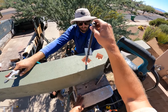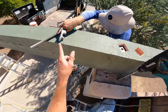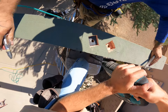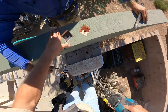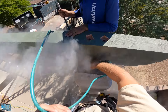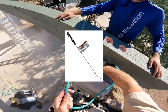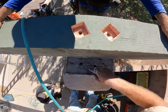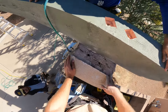One thing that's really important: after you drill it you've got to use an air nozzle to blow out all the dust. You've got to get all this dust out. They also sell a brush you can use to brush it out. I drilled mine in about five inches — I'd give it at least three to five inches of embedment.